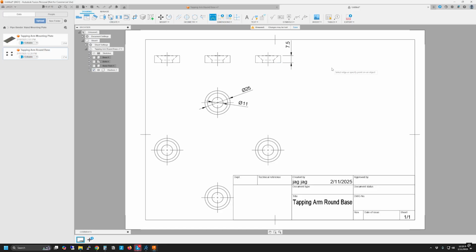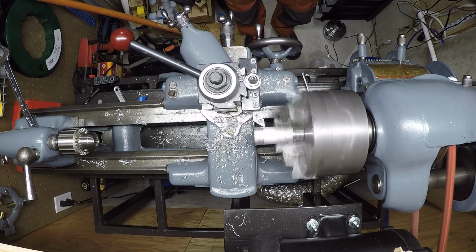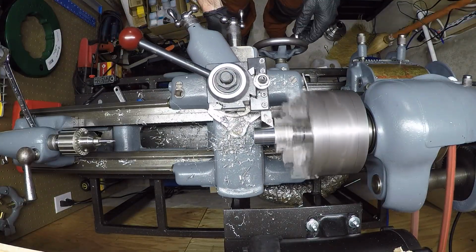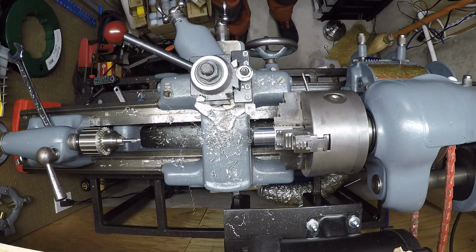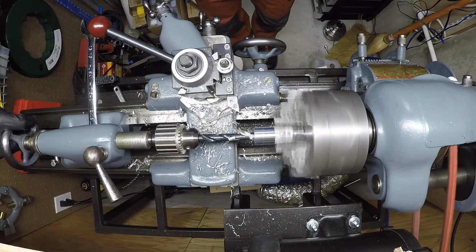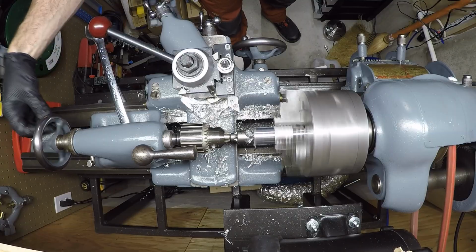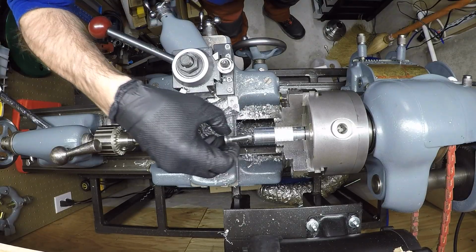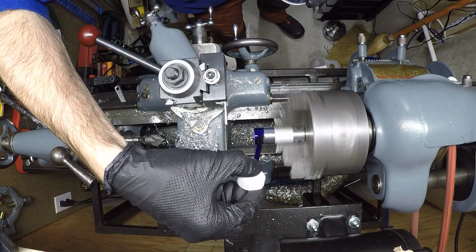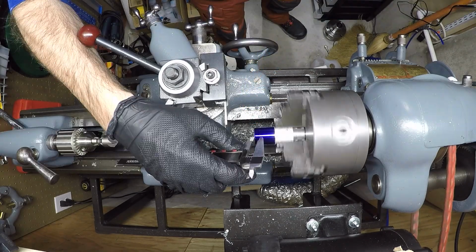With my part sheet done, it's back to the lathe to make the 4 washers. I trued up the end and brought the piece to diameter. I then drilled the 11mm clearance hole. I wanted the washers to self-center, so I used a countersink bit and went deep enough to match the screw head. I broke the sharp edge and added some Dykem blue. I used a small heat torch to speed up the flash off.